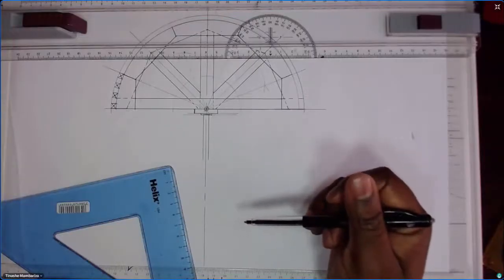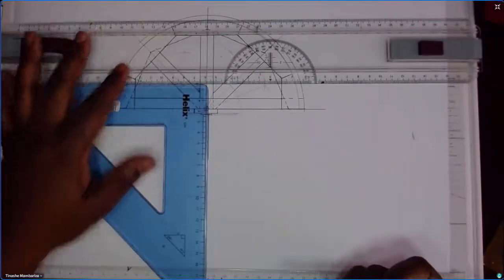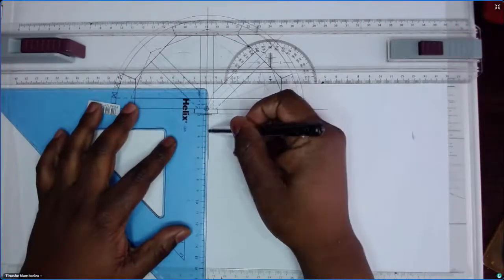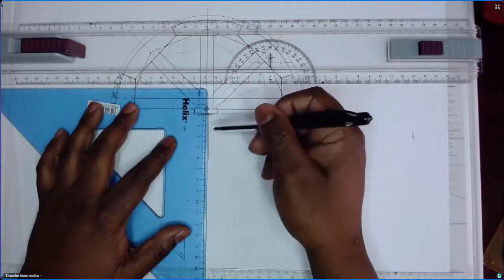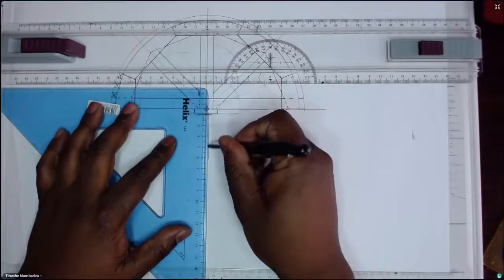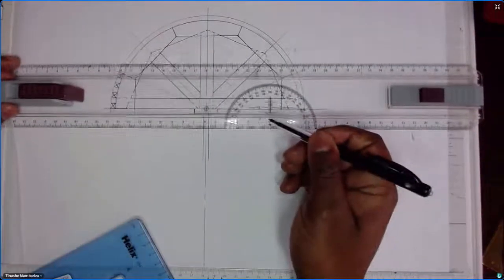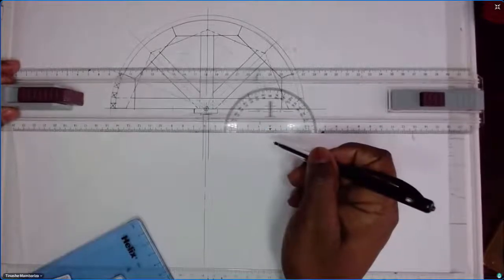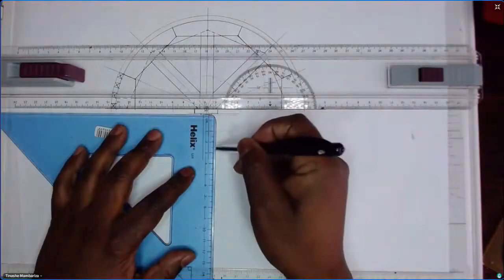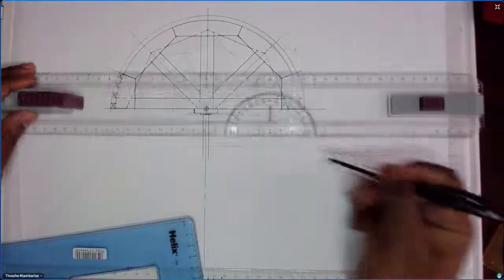will be at spacing of say 150 millimeters. So 150 millimeters divided by 10 is going to be 15 millimeters. So the first hole will be there, the second hole will be another 15 millimeters below. So you can draw, or you can show maybe the placement of 2, then we are good to go. So that's the first center there. Then from there 15 is here, so probably there.